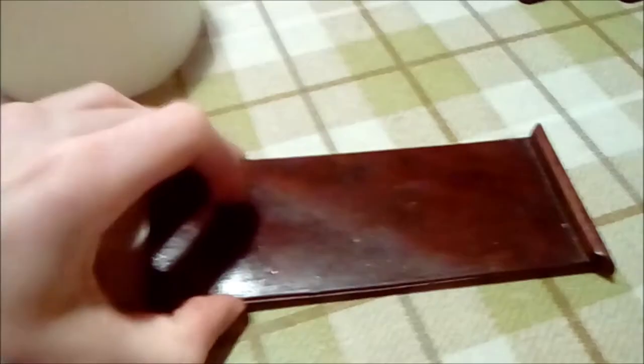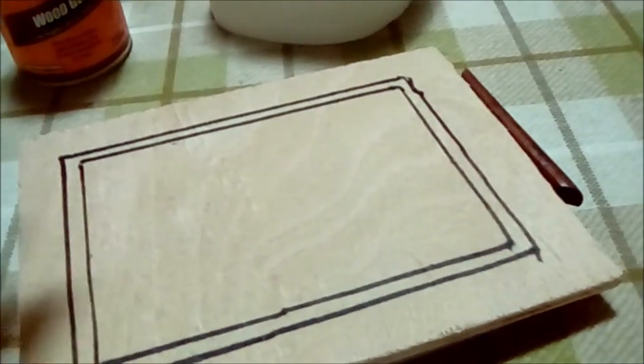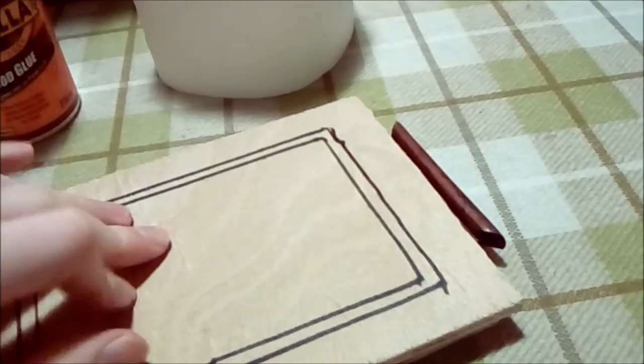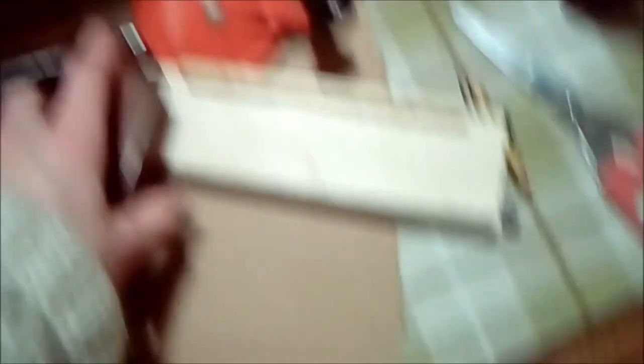I've finally decided it's time to tackle this problem in the drawer — this all should be perfectly flat and laminated. I'm going to get some wood glue — I'm using Gorilla Glue, first time I've used it so I'll find out if it's any good. I'm going to get two squares of conveniently cut plywood, fill the layers with glue, G-clamp them flat quite hard, wait for it to dry, and hopefully it will be flat. And wha-bam — this is the replacement bit I made. The idea is I'm going to drill holes into this bit here, here, and here, and put pins through, because there isn't any other joinery work and it takes a hell of a lot of weight.